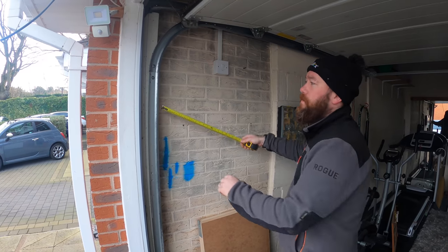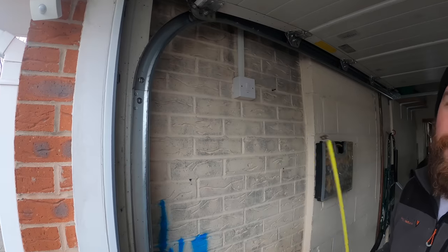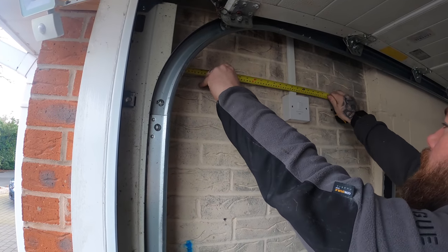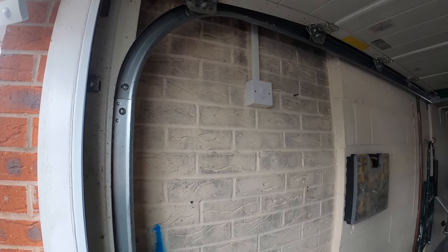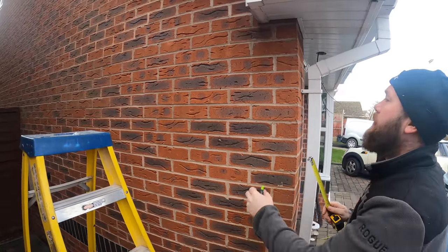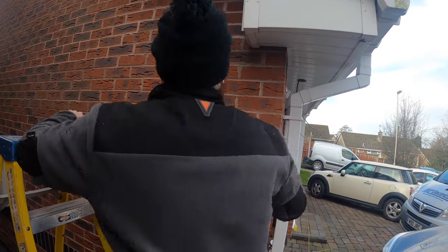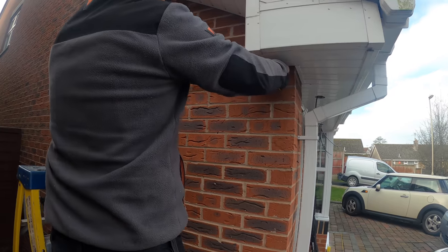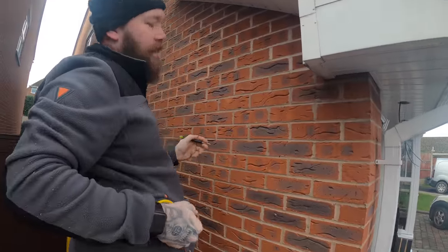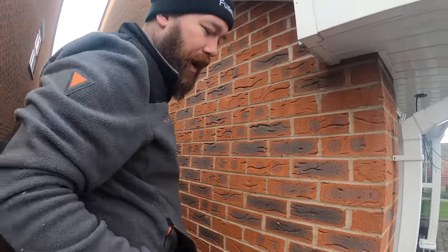So what we're gonna do is measure off this to the trunking, measure it the same outside, and then hopefully drill through just above the trunking. So from that batten pillar, it's 570. So if I drill out here, if I'm up 570 off the corner, mate, yeah. About that? Yeah. 570 is about there. And then it's got to line me up with the height, and then we'll blast through and hope we come out above the thing.